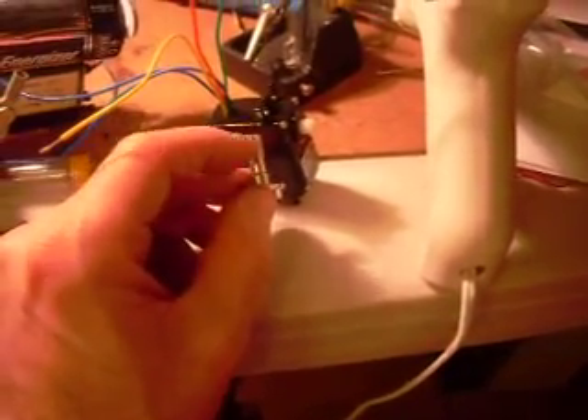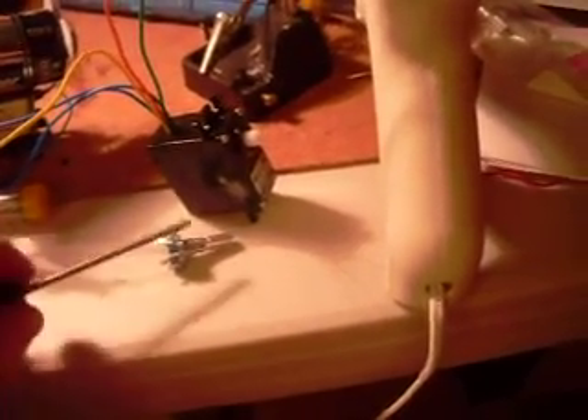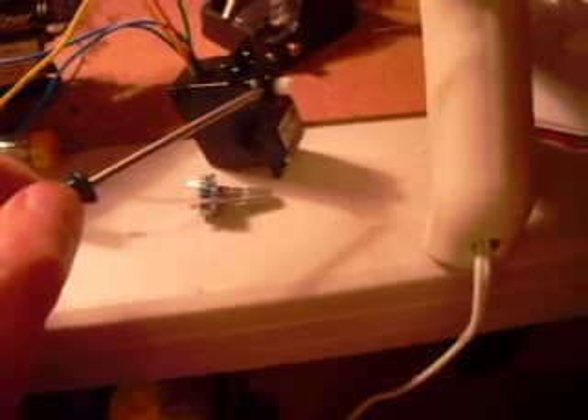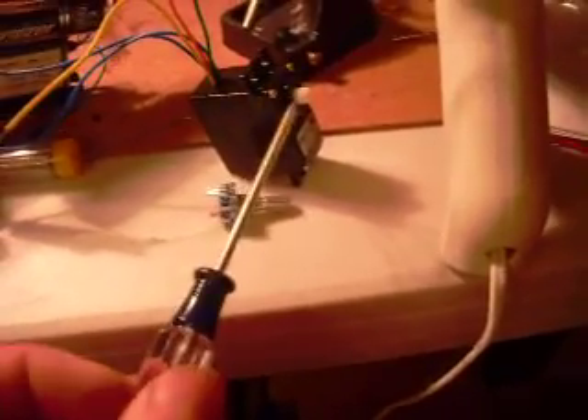I have a slotted shaft here, and I needed a way to mate this shaft with the inside of this gear. There is a little slot inside of there, but it's not the same size as this slot — it was a little wider and shorter lengthwise, not 6 millimeters. When I ground the shaft down, I wound up with two little extra pieces — actually I ran it with one, because the other shot off into the darkness of my garage. So I had one extra little piece of metal — one side of this that got cut off — and I carefully ground that down so one side fit in what was left of this slot, and the other side fit in the little slot in the gear. Fairly detailed bit of metal crafting, but it fits. Everything fit back in the box.